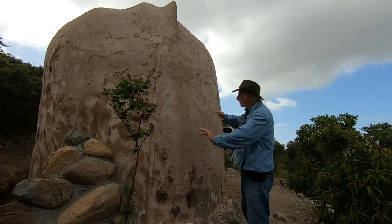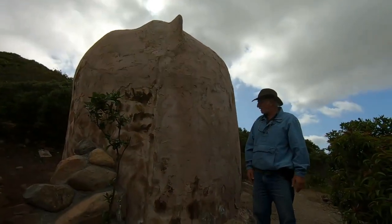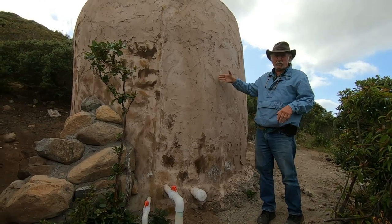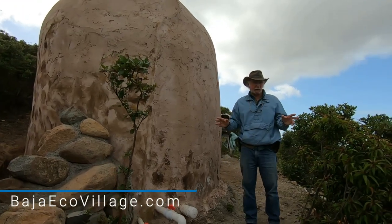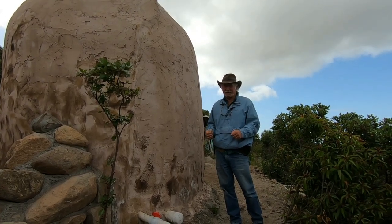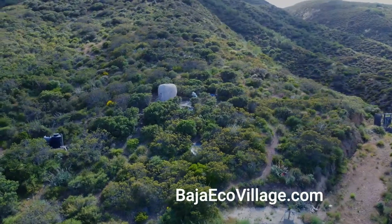I hope that helps. We did some color here and there to try and make it look more like a big boulder from a distance — you be the judge of that. We do have a place to sit on top, and it is strong. For those of you wondering, it's probably about three inches thick, maybe four at the most. As you noticed, it's got three or four different layers of plaster, cement, and concrete against all the wire and rebar. I hope that's enough to give you an idea about how to build one of these yourself. Thank you for participating and listening to this video. We'll see you next time.